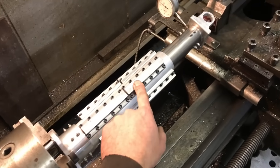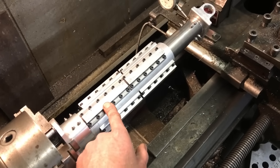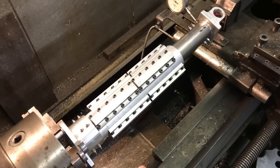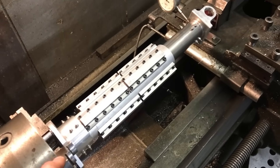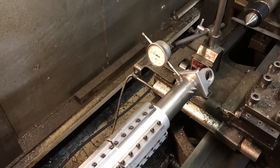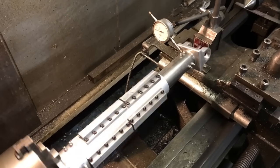I've reoriented these so that the shaft moves in and out easily and doesn't cause this preload problem on one particular bearing. I've tested it and it seems fine. But now we've got more run-out — it's now 0.6 of a millimetre, which means it's 0.3 of a millimetre off centre.